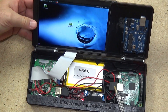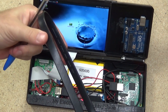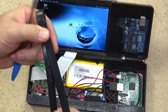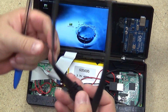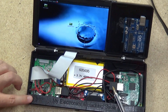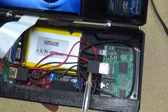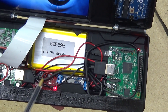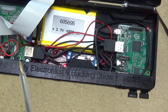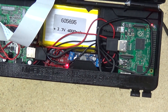One of the main changes is the HDMI cable. Previously I was using a full-size flat HDMI cable — nice and flat but as soon as you try to put a bend in it, it takes up far too much space. So I ordered a very fine 4-millimeter thin full-size HDMI cable, and it is just enough to snake in and around the project out of the way. And that covers all the main components: driver board, battery, SparkFun board, power regulator, and the Raspberry Pi itself.